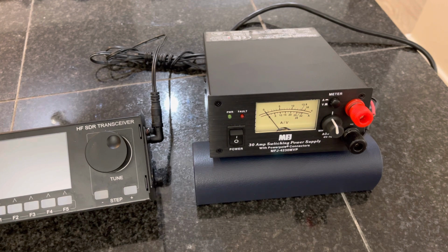Yesterday I had a great deal of fun, actually, building a very simple antenna. It's a 20-meter center-fed dipole. Now, 20 meters isn't the length of the antenna. It's the length of the electromagnetic wave that you're trying to receive, the radio wave. So that dipole is half wavelength, so it's close to 10 meters long, 30 feet long.